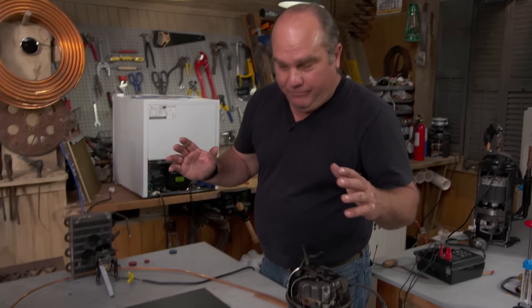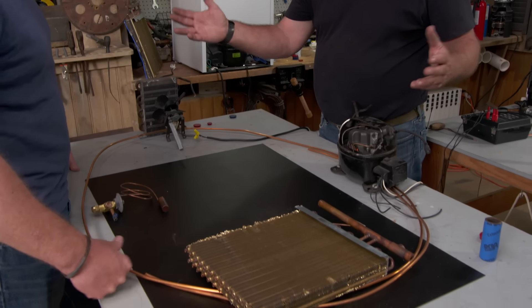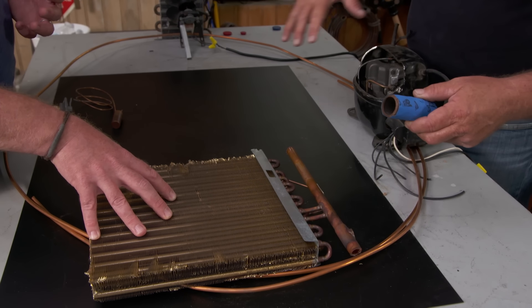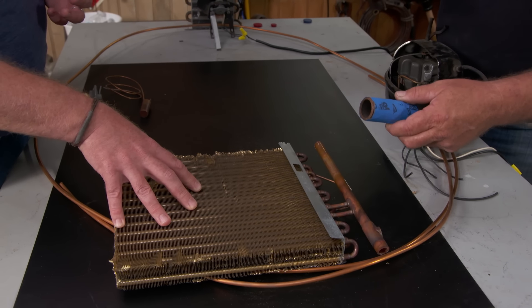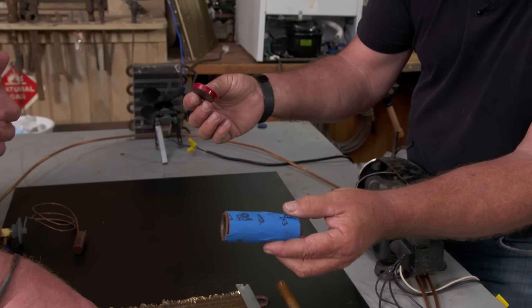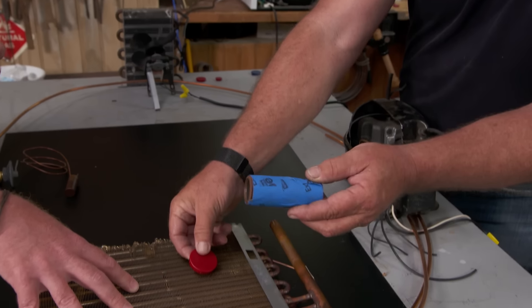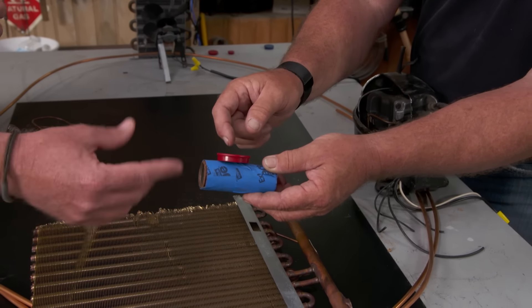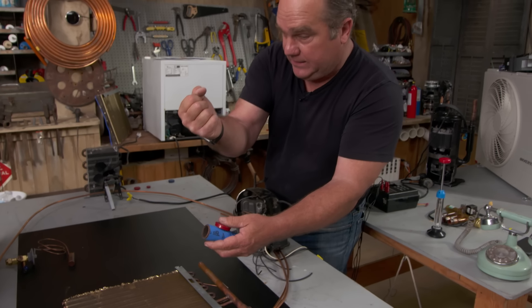This is a mock-up of how every air conditioning system around the planet works. It works on the most important principle in thermodynamics: heat always goes to cold, no matter what. The part inside your building has a fan going across a coil filled with refrigerant. If we can get that coil really cold, the heat in the air on a hot summer day passes by, and the heat has no choice but to be absorbed into the refrigerant.